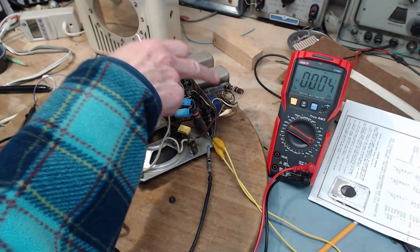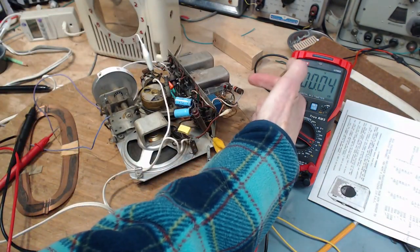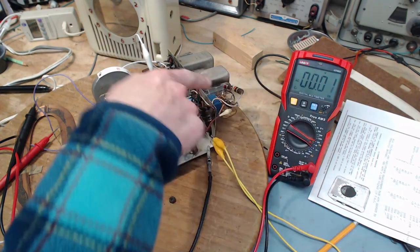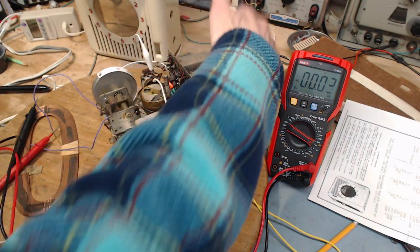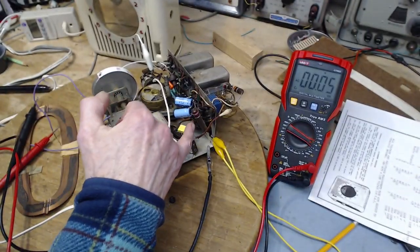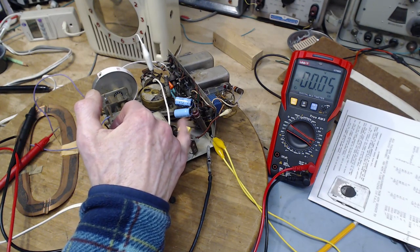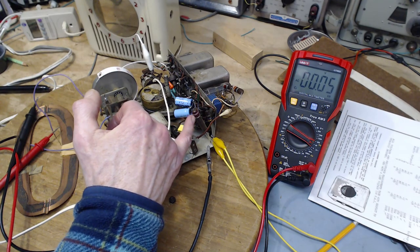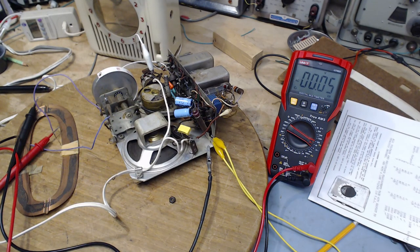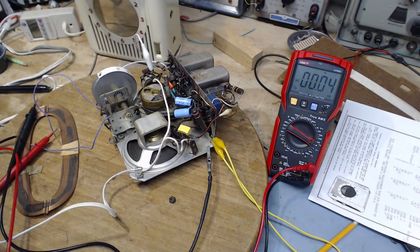So I can read the values. These look really new. Ooh, don't touch them. They might be really hot. So this one's a 33 ohm, and this one's a 22 ohm. This guy, it's got a pinkish colored band. That's probably supposed to be 7. It's probably 27, probably 2700. And this last one looks like it's been overheating. What is happening with all these?